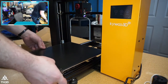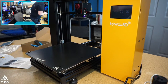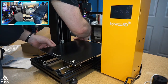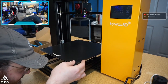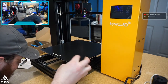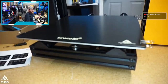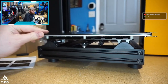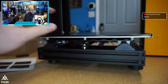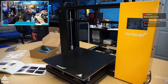Not a fan — I can see the bed is not lined up correctly with the rods, and there's way too much slop. Where is the slop coming from? It's not the bearings — it's the bed. The screws that hold the plate to the carriage aren't tightened down. This probably loosened up in shipping. A relatively simple fix — just tighten those screws.